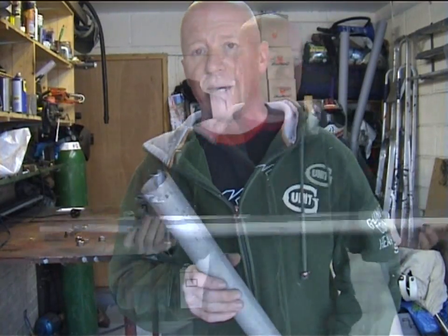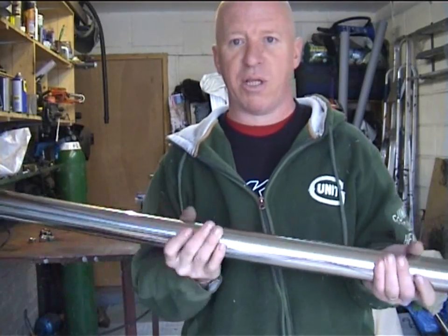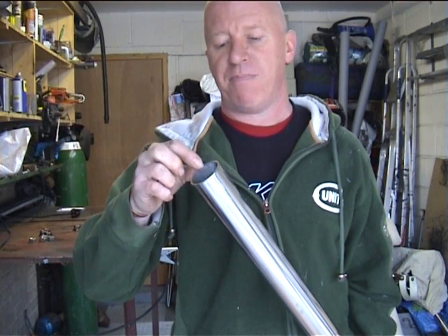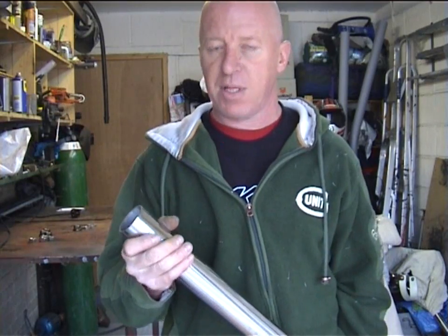Once we've cleaned up, the tube is now all a nice mirror finish. What we're going to do now is make the threaded inserts that go inside here, so we can put our 20mm stainless axles on to fit the wheels.